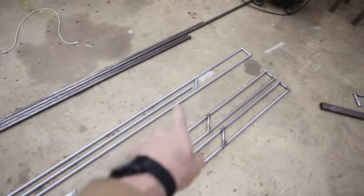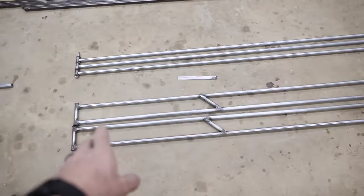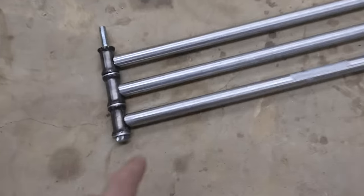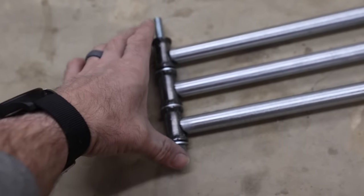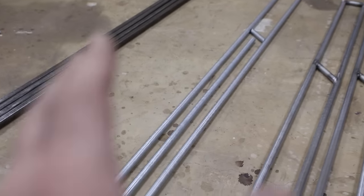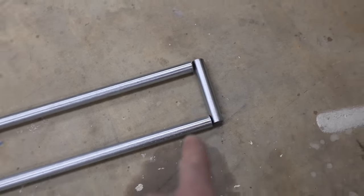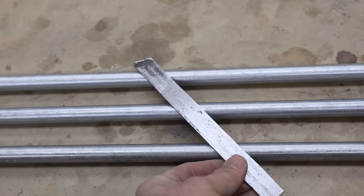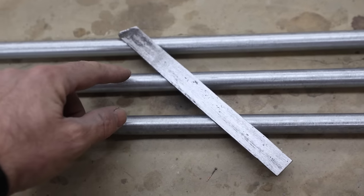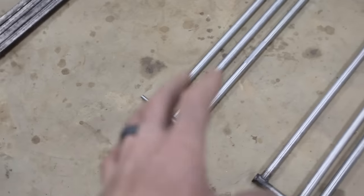For the sake of time, I went ahead and cut and notched everything. The third arm is 86 inches — two inches longer than our completed seven-foot arms. We have two rails at 86 inches for the top and bottom, and then the fourth arm, which pivots, is at 63 inches — I left it a little long and may trim it later. We also have an angle piece to match the other arms, a four-inch piece, and since we can't have an angled piece across the middle without interfering with the fourth arm, I'll use a piece of flat bar welded in to support the top and bottom rails while letting the middle arm fold inside.